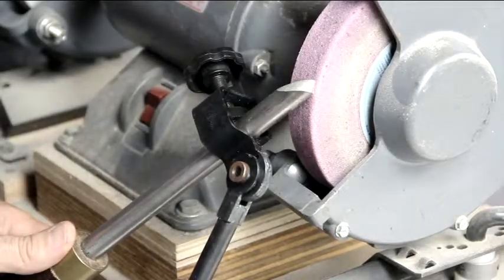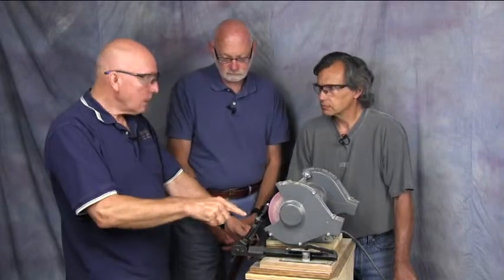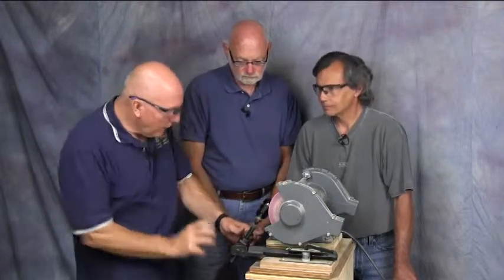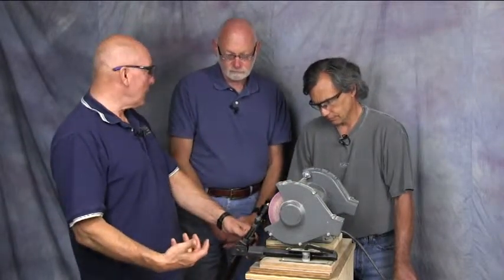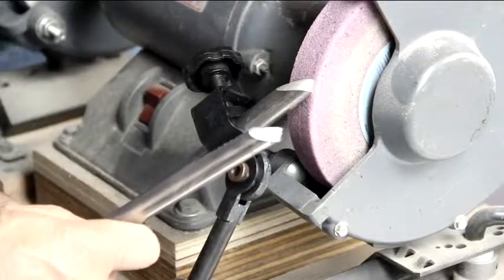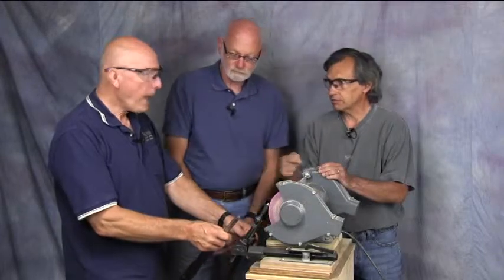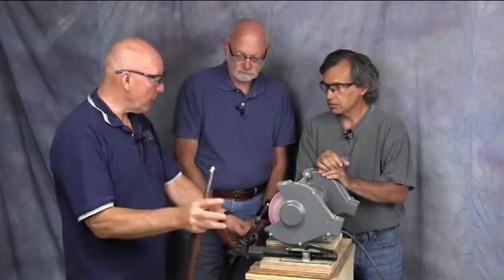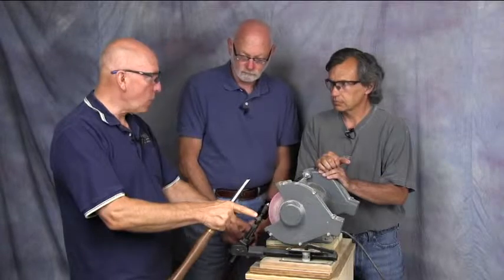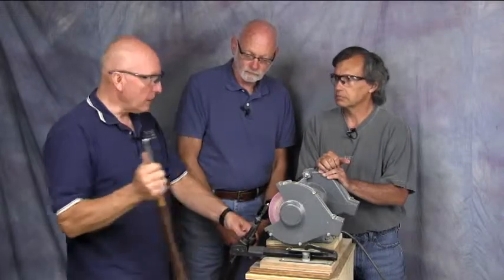That little change here makes a big difference in what you get at the end of the tool. With other systems that aren't locked in, people have to manipulate and exaggerate the motion to reproduce this kind of grind. When you come back to a tool with a grind you've already done, it's very quick to touch it up again. If I'm using the same tool over and over, I don't have to move the arm in and out or change anything — just slip it in to the right length, sharpen it, and back to turning. Very consistent and very quick.